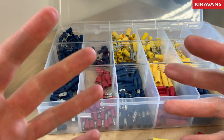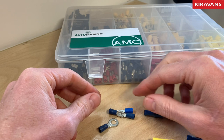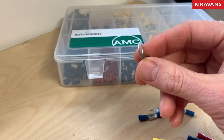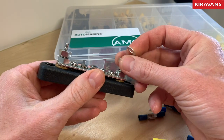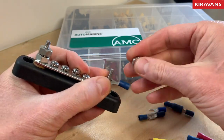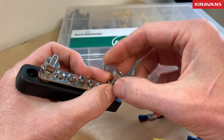Once you've figured that out, you'll see that within each colour we've got various different shapes of terminal. This one, for example, is called a ring terminal, because it's got a little ring on the end. This would be useful if you want to put it onto something threaded — you could screw that down. That's a very secure way of getting a connection onto a threaded post.